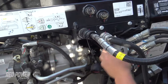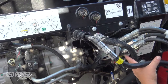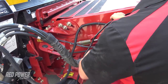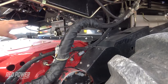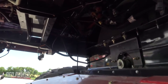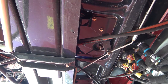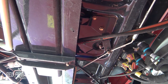We plug in right here next to our other single point connector to the left — that's where this harness is going to plug in. You're going to want to zip tie right next to your main harness on your combine so it becomes a nice clean install. From there, your harnessing is going to want to follow up through your pivot areas. On a common cab combine, there's a plate right up under the center that you can take out, and if you take that plate out through your floor mat, you can cut a slit in there and run this harness through. It comes up under your buddy seat and from there you can run over and come up on the right-hand side of the console for a nice clean install.